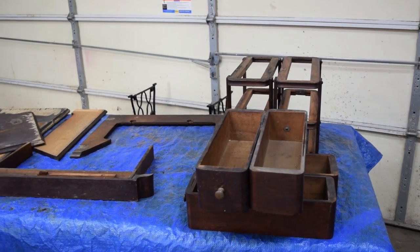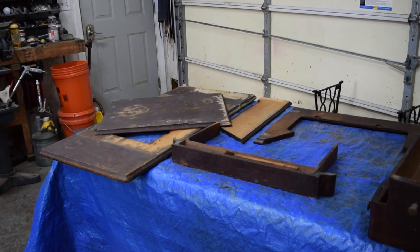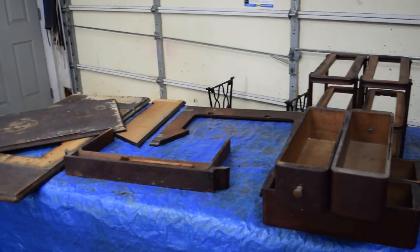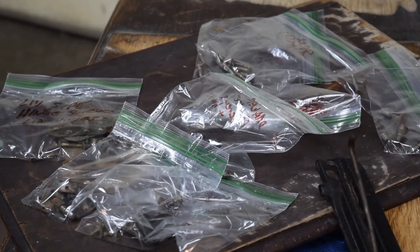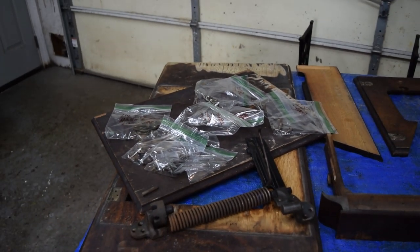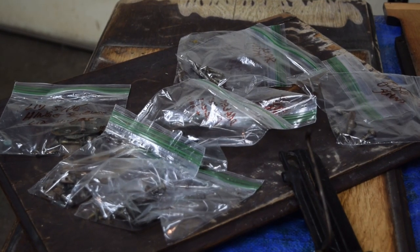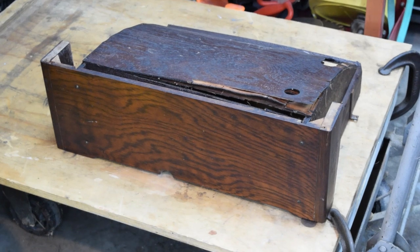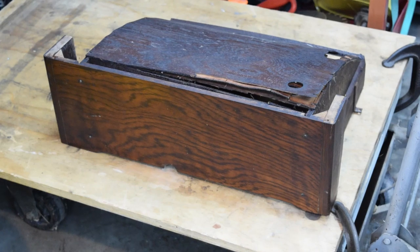And this is the fully disassembled cabinet. Pretty much all the wood parts are going to have to be repaired, re-veneered, and refinished. And in these bags is all the hardware that I pulled off of the machine, including that spring assembly. Every single piece of that will get cleaned, wire brushed, lubricated if it needs lubrication, and painted if it needs to be painted before reinstalling. Oh yeah, I've got the treadle assembly over here on another table. That's got to be fixed too.